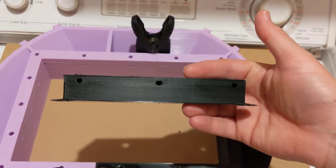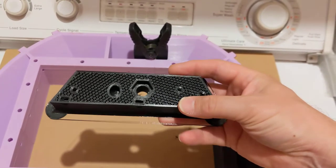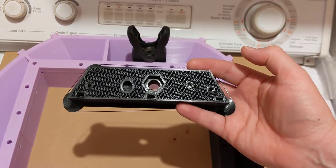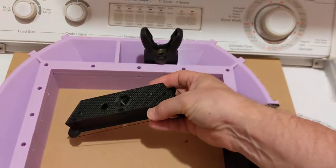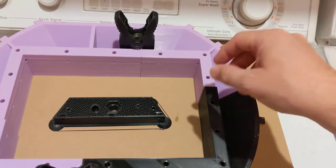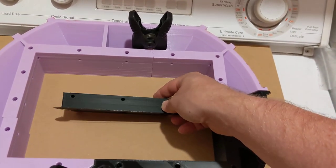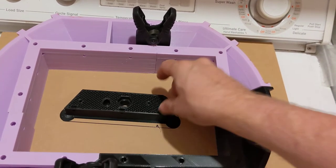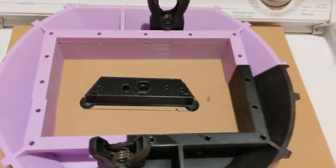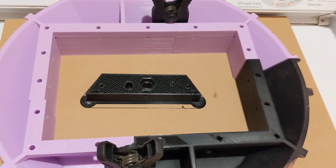Unfortunately, this one here, which is over a 5-hour print, I went out to get lunch. I came back, it was this far done, and the nozzle was above it, just continuing to act like it was printing, but it obviously wasn't. And there were little blobs of black PETG all over the place. So what happened is that the extruder quit extruding filament into the nozzle.